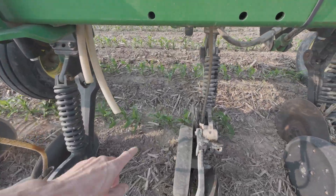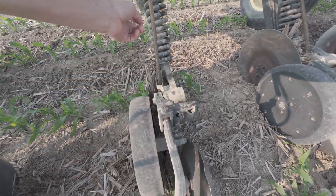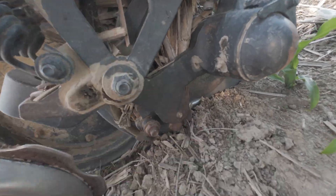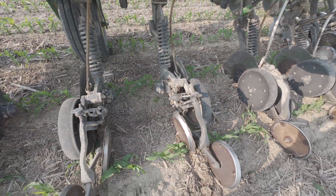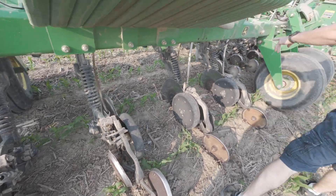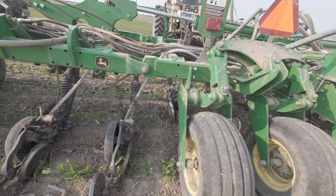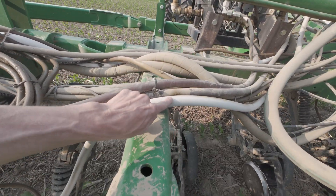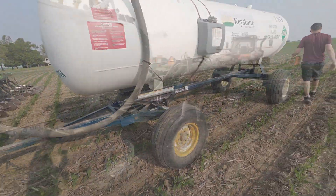See, they run this blade on a slight angle and a line runs down - there's a boot, kind of see it right here, it's in the ground. That's where the anhydrous ammonia goes in. Make sure all the lines are sweating so you know what's going on with all of them. See, it gets so cold it makes the lines freeze - there's a frost on there. It's some wicked stuff.